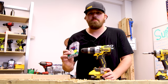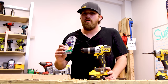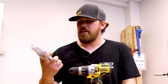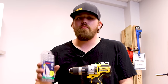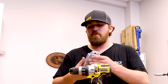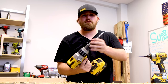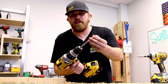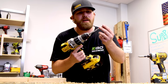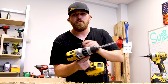What we have here are Bosch multipurpose bits. These will drill through brick, tile, masonry, and even PVC — they're our favorite masonry style bits. They go from 5/32nds all the way up to 3/8ths and work perfectly with this DeWalt hammer drill. When drilling through masonry, use the top speed — the faster the material moves up through the drill bit head, the quicker you'll drill the hole and the cleaner it will be.